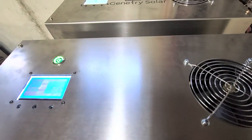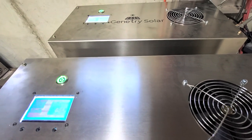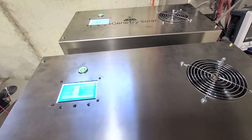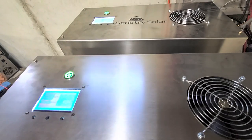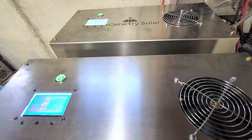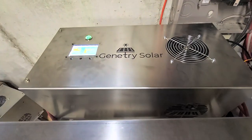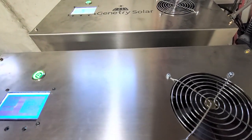That is where we are trying to tweak. I don't want anyone to get their hopes up about having 24 kilowatts of surge between two inverters, but we are still working on that. What we know so far is that a single 6,000-watt inverter can surge to at least 20,000 watts. Now, there is a caveat: this one here is not warranty locked, while this one is warranty locked, and we have to do some tweaking to find out the difference.